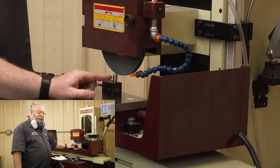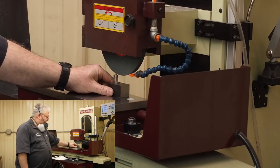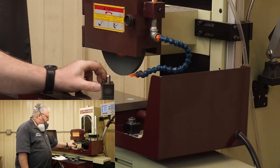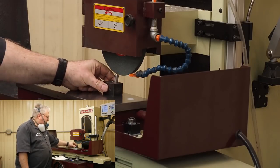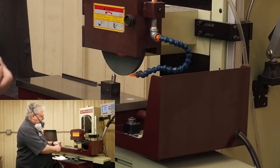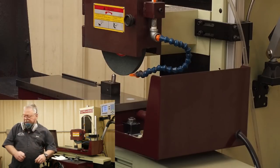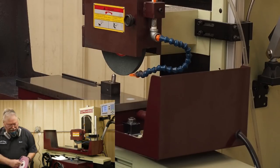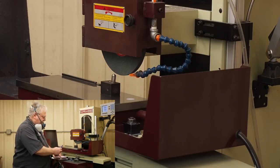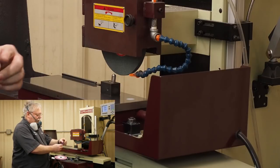It needs to be on an angle, but it's not for that reason. You want to turn this diamond this way. You can also use it this way or this way. You do not want to do it this way, because if you turn your diamond this way and it's pointing to the center of the wheel, as you dress that wheel, you're grinding on the point of that diamond, and you're grinding a flat on that,